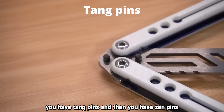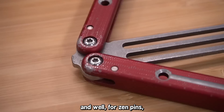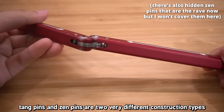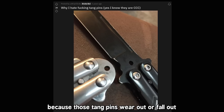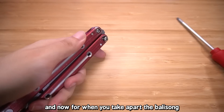A lot of people on Reddit recommend Wiha drivers, and I do have one — it's pretty good. There are two types of handle constructions: channel handles, which are fully filled out with a recess for the blade to sit in, versus sandwich construction, which is two pieces of metal sandwiched together. Then there's the pin system, which stops the handles from swinging completely around the pivots. You have tang pins — recognizable by the two pins at the base of the blade that contact the handles — and Zen pins, recognized by the Zen nipple, which contacts pins inside the handles. Tang pins feel more controlled while Zen pins feel bouncier.